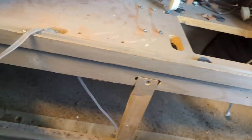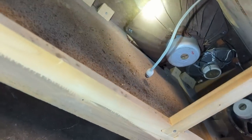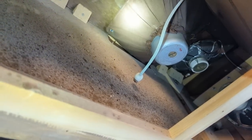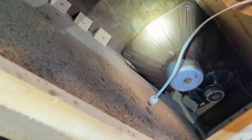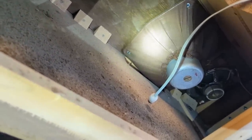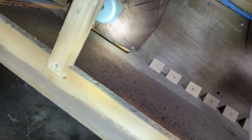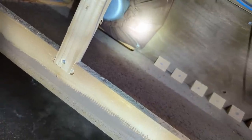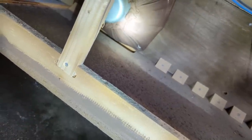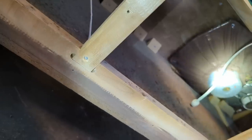I'm disappointed — I thought this had oval speakers but it doesn't. It has these god-awful speakers that almost always have very delicate foam rubber surrounds, and they're probably bad. There's literally no way to fix those. What I tend to do is put in a pair of 10-inch speakers — these are 11s but 10s will fit just fine. The wood is thick enough. I'll overhaul it and check just on the off chance they're still good, but I doubt it.